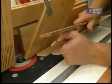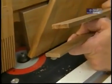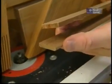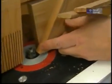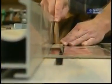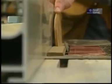The material for my slat starts out as 1/4 inch thick, 1 1/8 inch wide square stock. To round over the edges, I'm simply using a 1/4 inch diameter beading bit. Here I've beveled the top slat to meet the rail at 25 degrees.